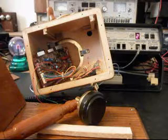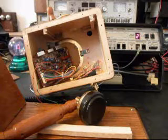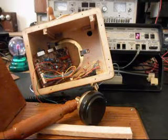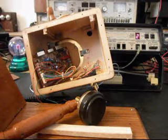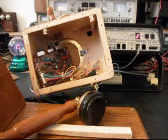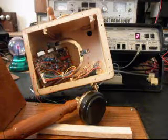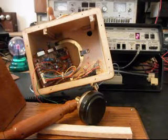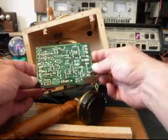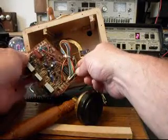So in the earlier part of the initial checkout piece of the video, we showed that with the old tone generator IC, we'd get key bounce, and pound and star, or star and pound, were not working at all, period. Now that we've replaced everything, the tone generator IC and the crystal, we have everything back. So I'm going to take a short break from the video and put the telephone back together again, and we're going to do all of our final checks.